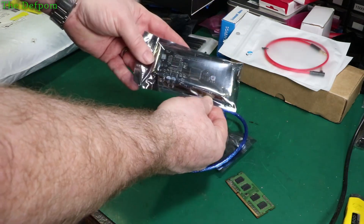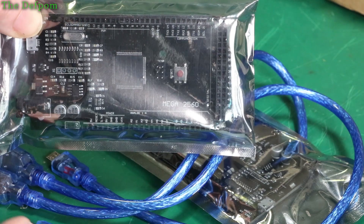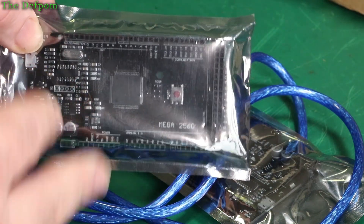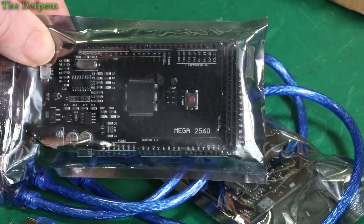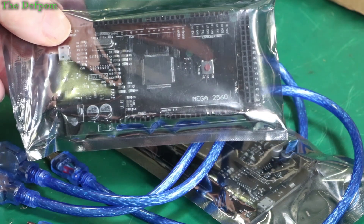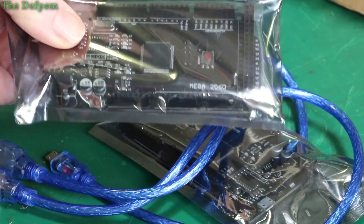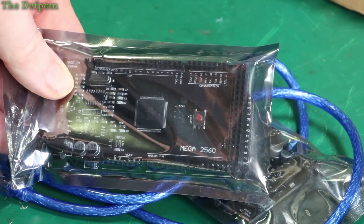A couple of Arduino Mega 2560s — these are the big Arduinos with all the I/O, heaps of serial ports and everything. These are my fallback position — if I couldn't get the ESP32 to work properly I'd use these instead. They're significantly bigger, but it's still an option. Hopefully I don't need to go there, because you can always add a wireless shield or Ethernet. I think the ESP32 will do what I want — that's what I've been developing with anyway.